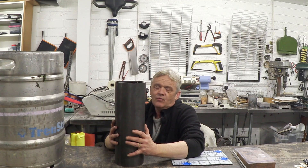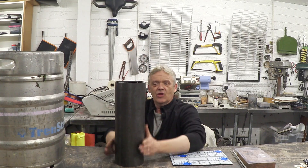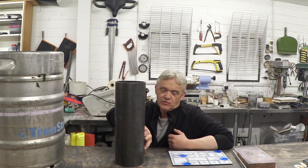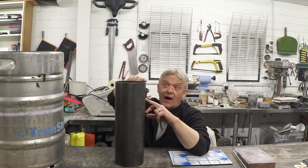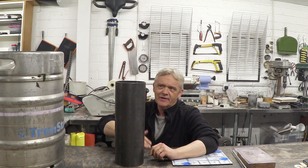The style of gasifier is a downdraft stratified gasifier. We stuff it full here, light a fire here, and all the air is sucked down. It's stratified because everything happens in distinct layers. The ash forms at the bottom layer. Above that is the reduction layer. Then there's the bit that actually burns. Then the pyrolysis layer where it gets turned into carbon. Then a drying layer from all the heat generated. Then the biomass you put in at the top, which gradually falls down as it works. You keep topping it up to maintain those layers — it's kind of self-leveling.